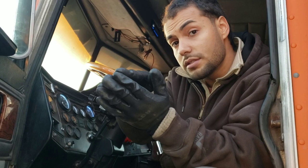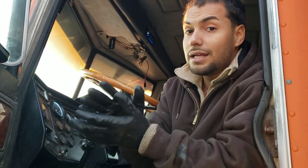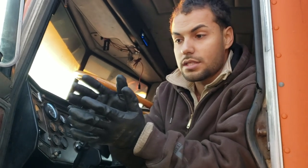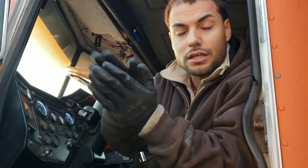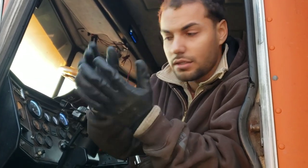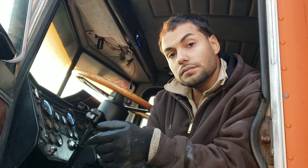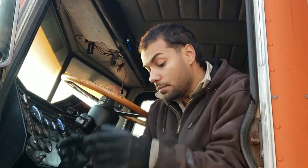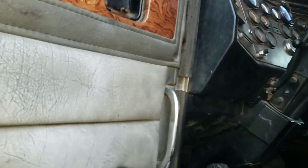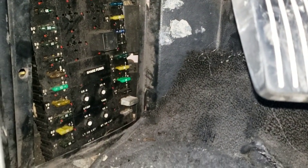What you can do is squeeze these pins and contacts back together tighter, put the fuse in, and that'll eliminate the problem. But I will say this — it's kind of a band-aid, to be honest, because the copper pins become fragile and eventually start breaking. They lose their spring tension and start spreading open. If you bend it a little too much, you might just break the tip off, and that's when you have real problems. It might only be a one-time fix where you just squeeze the pin together, and that's no problem.